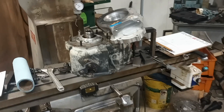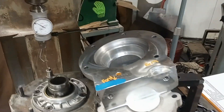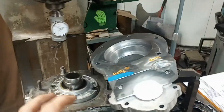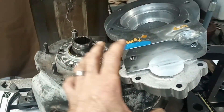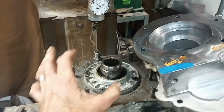We're definitely not using it in the factory application. We've got this strapped onto the backside of a Chevy or Muncie SM465, using an adapter to put a Borg-Warner transfer case onto an SM465, trying to keep it compact and strong. It's this Frankenstein of parts. The obvious issue is that this bolt pattern is not on this transfer case, because this is a Chevy or Dodge-style transfer case and we're trying to bolt it up to a Borg-Warner pattern.